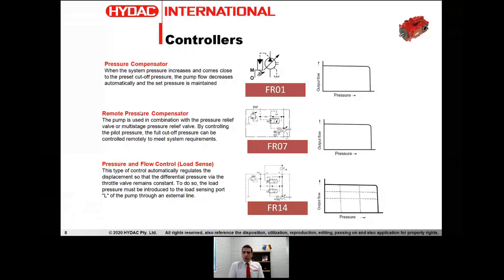The pressure compensator controller: we have a setting on the pump such that when the pressure reaches that particular setting, the pump will decrease its swash plate angle and as a result stop producing flow, or decrease the amount of flow rate it produces, to maintain the pressure and not exceed the horsepower requirements set by the electric motor. As you can see on this graph, as the pressure increases and once we reach that particular setting at the tip of the graph, the output flow will be reduced and the pump will maintain the operating pressure. This line — the vertical line — can move left or right based on the setting of the pressure compensator.